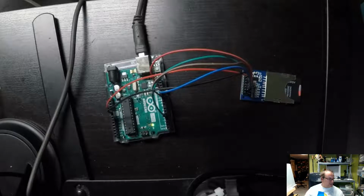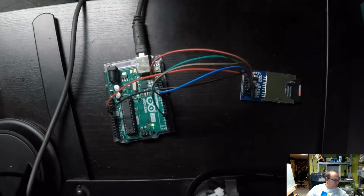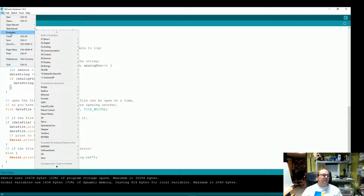It was actually surprisingly easy to get working. The micro SD memory card just needs to be standard formatted to the FAT file format, FAT32. So that's nothing amazing. Usually they come pre-formatted like that. And if you're running an Uno or any card that's supported Arduino style, the libraries for this card are available directly in the menu, so you can take the examples. They're here directly, so you don't need to actually look at this.